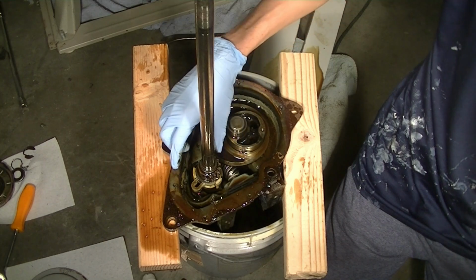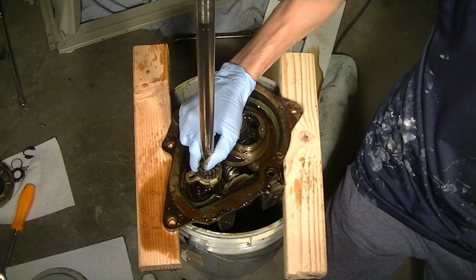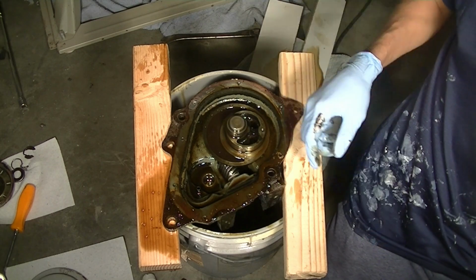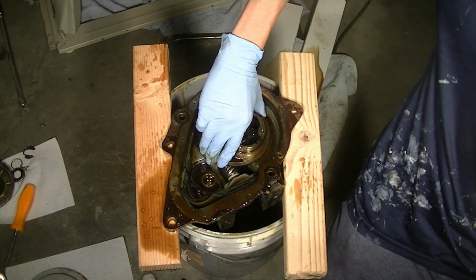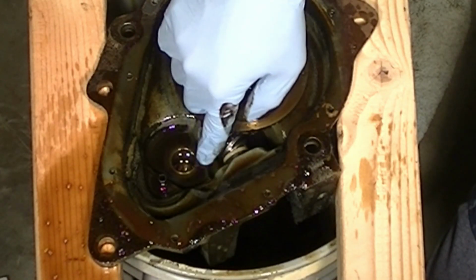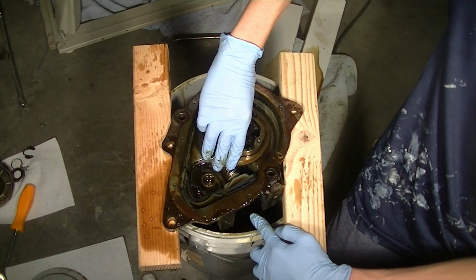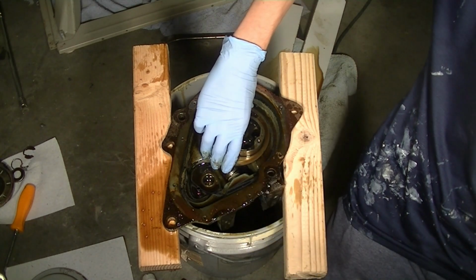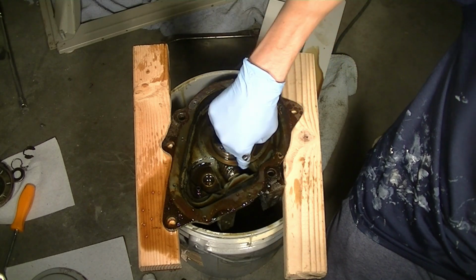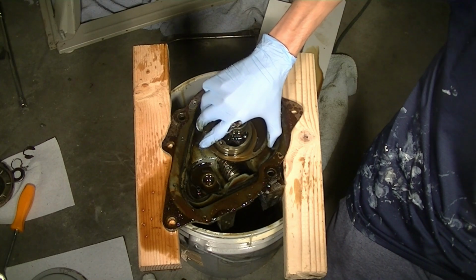And then this entire agitator shaft should just lift out of the hole like that, out of the pinion or whatever. And then this drive gear, this main, which, as you might be able to see, is spun. If you've never seen the inside of one of these before, the main input shaft turns into like a worm gear, which spins and drives. There's teeth underneath this gear on the bottom side that mesh with this, and that transfers power to the rest of the parts.